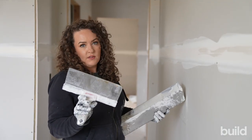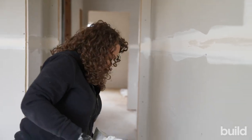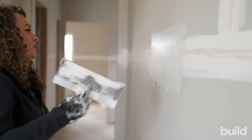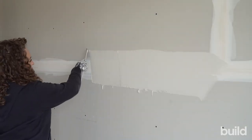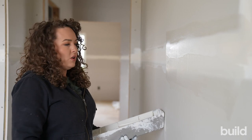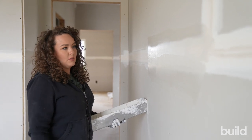I'm going to be using a knife just so I can demonstrate — you can also coat these with boxes. Just make sure you're checking your boxes and not overfilling because every job is different. I am using plus three. I'll go ahead and put my mud on my joints and then take it and cut my edges. The reason I'm cutting my edges is because I don't need to go really far there — if I have a bunch of mud outside of my bevel, it's just going to make a mess. You just slowly feather everything out instead of hard edges; you have nice soft edges and then you work on feathering.